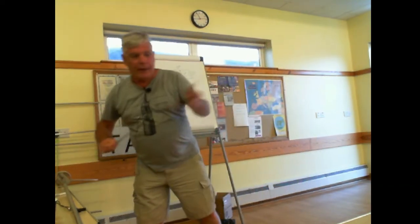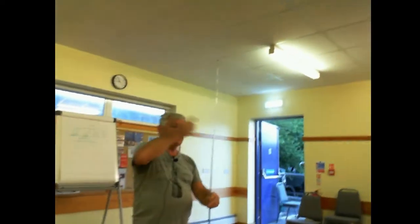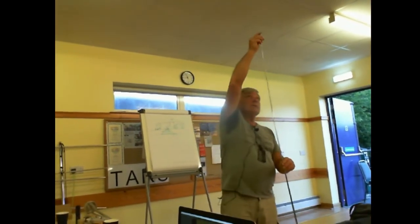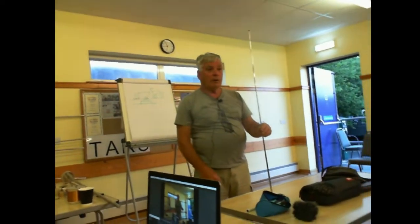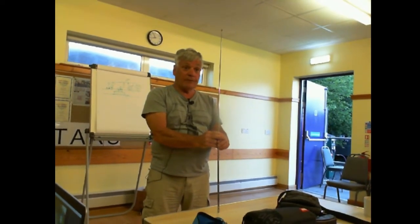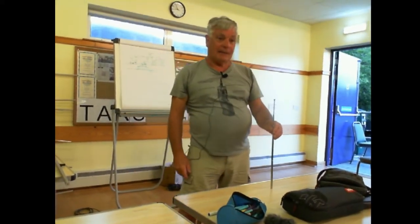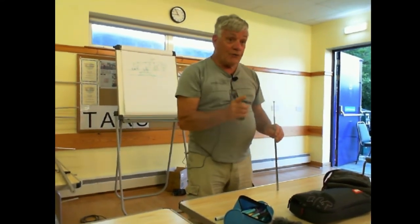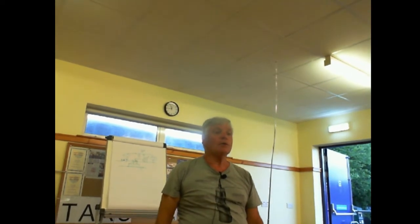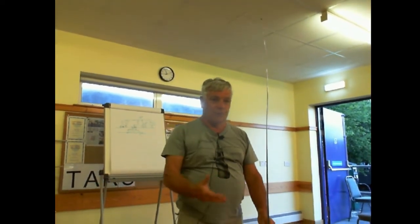So, here's our antenna, lambda by 4. That's great. And it will produce its lovely pattern, and it's a full 300 ohm resonant antenna. Do that, and it's not resonant anymore because it's not the right length, but it is still fully efficient, 300 ohms. Now, if we get down here, and we assume that that is lambda by 10, we're still okay. What we've lost is bandwidth. Always remember that. This will give you 25% bandwidth on a decent, proper ground plane. 25% to the 2 to 1 point. That's how we normally measure this, to the 2 to 1 points.